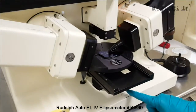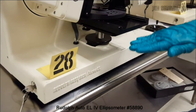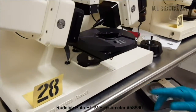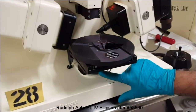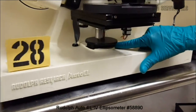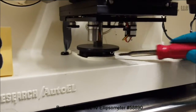There is also a big disc at the bottom of the stage. This disc is used to raise or lower the stage in order to compensate for the thickness of the samples. Before adjusting the big dial, there is an Allen screw under the disc which has to be loosened. Once you loosen that and rotate the disc, the stage will move. The Allen screw is a quarter-twenty size.